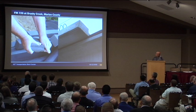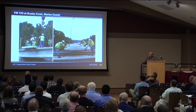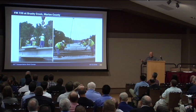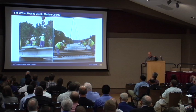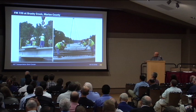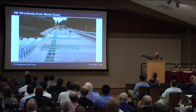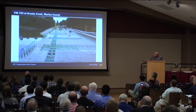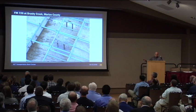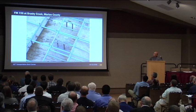These are the panels being placed. As you can see here, they're going to have grout pads. They'll level the panels up, put grout pads in, and that's what keeps the panels at the right elevation. There's that gap region I was talking about — a lot more visible. You can see the dam. There are the ledges I was talking about. That's to integrate the panels so we can keep them acting as one unit.